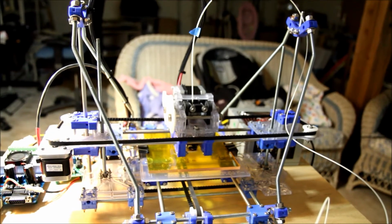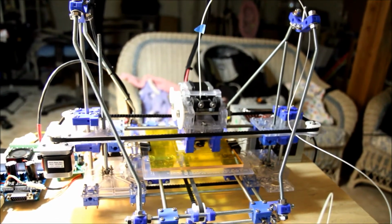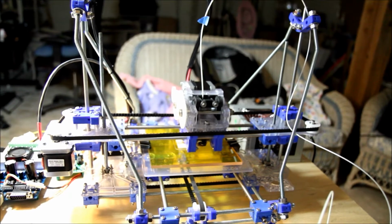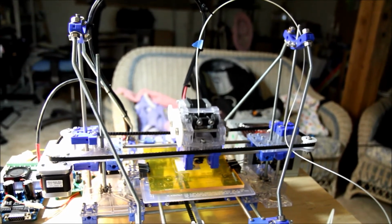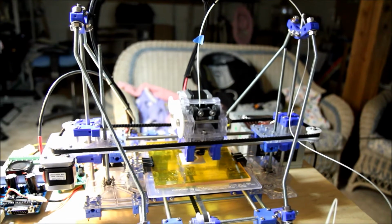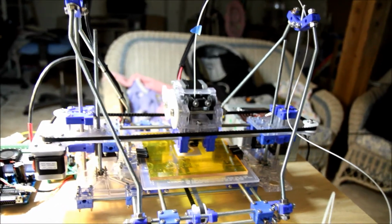The problem I have right now is that it is extruding very slowly, and the filament is coming out very thin, at least more thin than I think it should come out. But also, if you look at the tape, you notice it goes up, retracts, but then it doesn't go back to where it was immediately. It's kind of inconsistent. The last thing I need to do, evidently, is to hob one of those bolts.